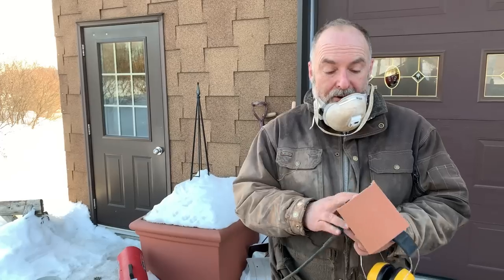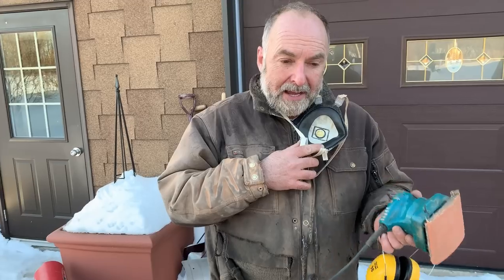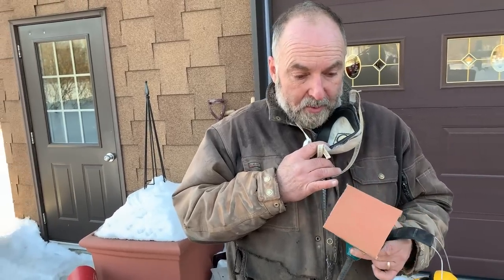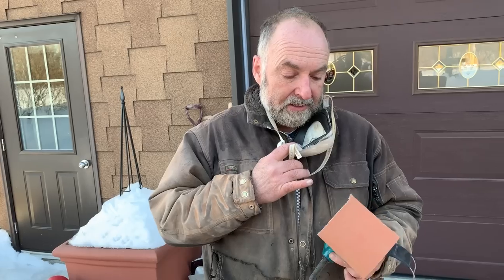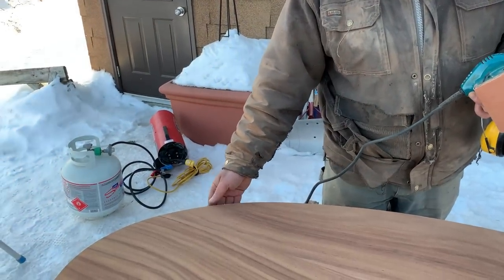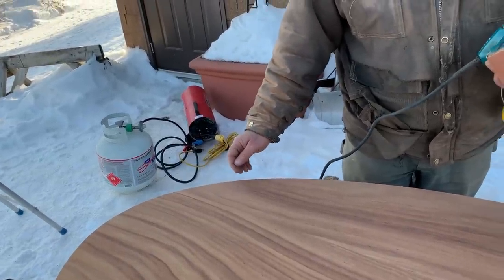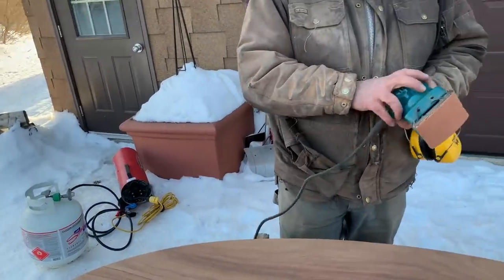This is my trusty quarter-sheet finishing sander. I've used the belt sander at 80 and 120, and I've gone over the tabletop with 180 in this sander. Now I'm going to go over it with 220, same procedure for the edge. That will be it for the machine sanding. Then I'm taking this into the shop to do some hand sanding parallel to the grain, looking very closely at everything as I go. I'm also going to slightly round the edge with hand sandpaper to make it more chip-resistant, and then we'll get to that oil finish.